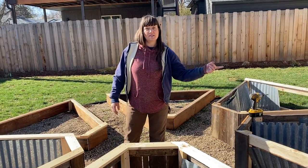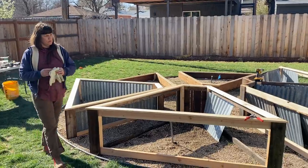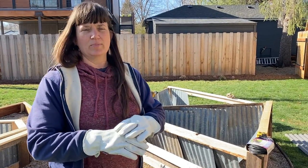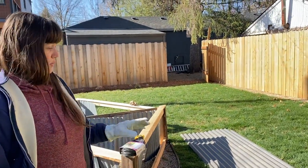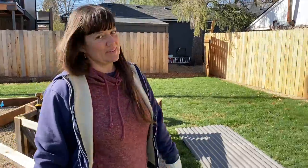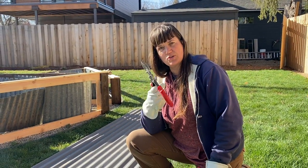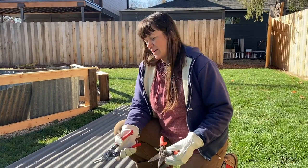I'm going to grab some gloves and then we're going to talk about how to cut tin if you want to do some kind of a project like this. Use a really good set of gloves — don't use something that's too thin. I usually use leather ones or really thick woven bamboo ones covered with rubber, because if you're going to get cut, it's going to be bad with tin because you are making a razor edge. Paul has an injury from the tin — it got him through the gloves. So basically there's a technique to use: make sure you're going to use tin snips. There are all different kinds — this is a long straight-cut tin snip, and this is more for making shapes, that kind of thing. We get these sharpened every single year, because if you don't, it's miserable and you're having to work really hard to cut this. You definitely want a sharp tool.